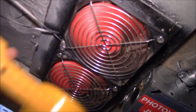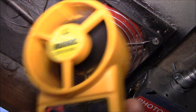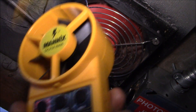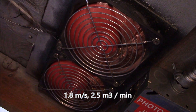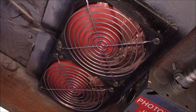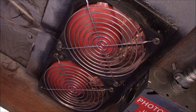Here's my airflow meter — this is a Mannix DCFM 8906. Let's take an air measurement here. We've got 356 feet per minute airflow. I've programmed in the size of the duct, and that gives us 89 cubic feet per minute. There's this pair of fans, another pair of fans about 12 feet that way, and on both gable vents there's another pair of fans on each gable vent.